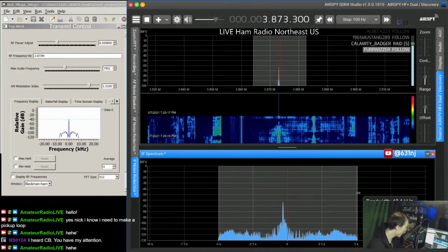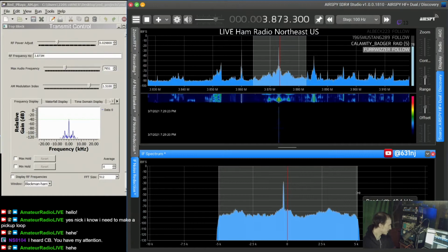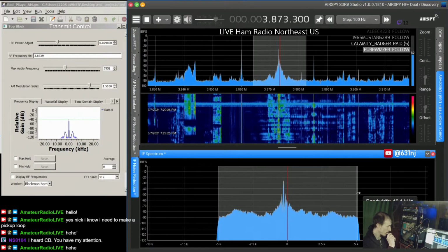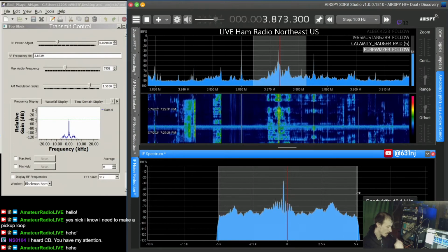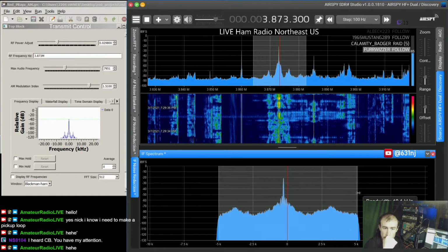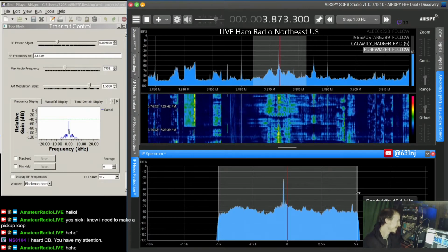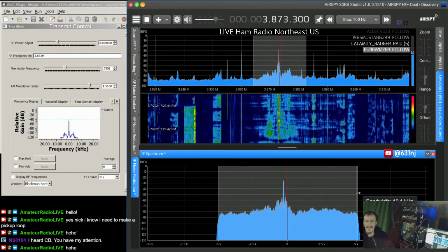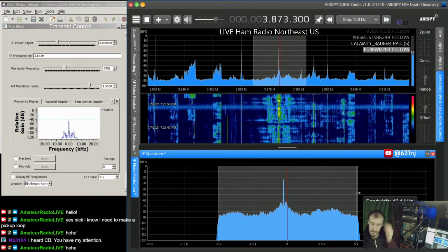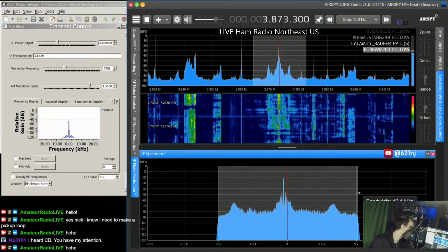Yeah, exactly. You just need a bigger amplifier after that 811. Check to make sure that the amplifier you've got can be driven harder on AM. A lot of those rated amplifiers are limited in their ability to amplify AM because it's challenging. It's got a carrier and it's got sidebands, whereas if you were just using it on sideband, it would only have to deal with a single sideband. But on AM, you've got a carrier and two sidebands, and that's very demanding on an amplifier.